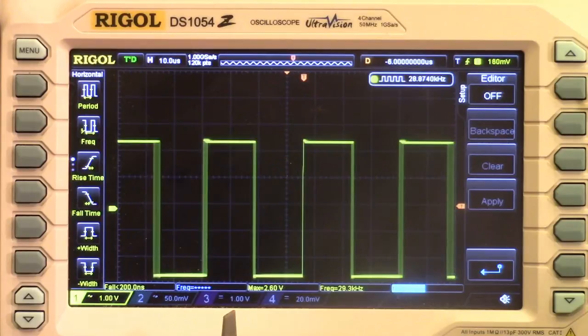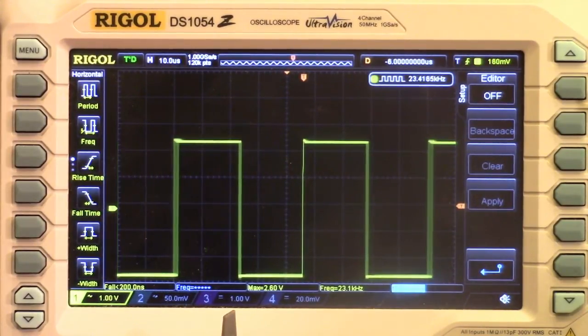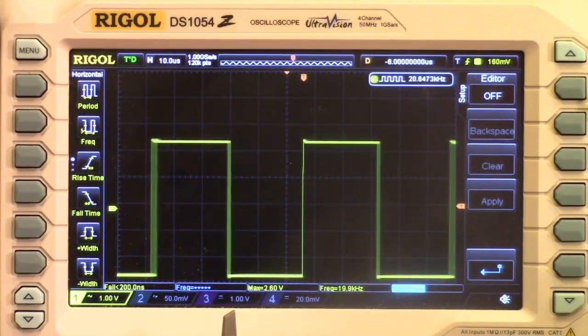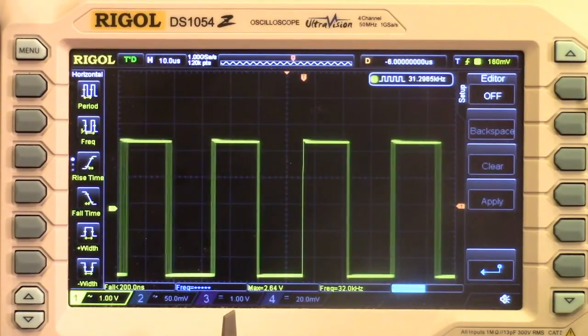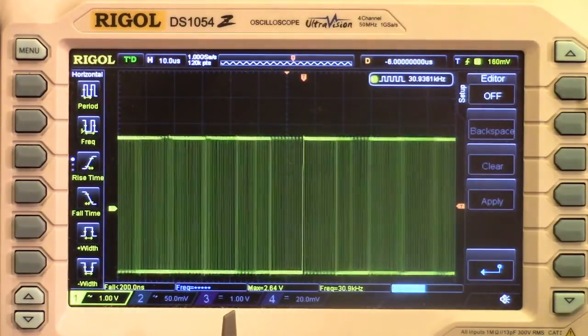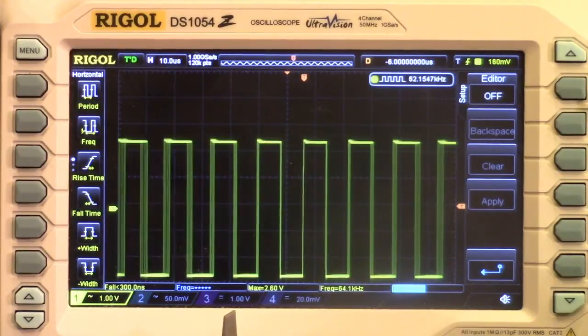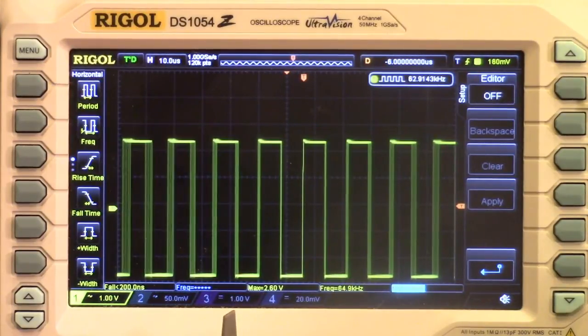Now if we go to clear, what happens when we go to clear? That's a mystery to me. I'm not sure what the purpose of that is, other than just a light detector, just any color. I mean, that would be the obvious thing. Clear would be, I need to switch S3 and S2. That's easy enough. And now I have S2 high and S3 low, which is clear. Now we're looking at a clear filter.